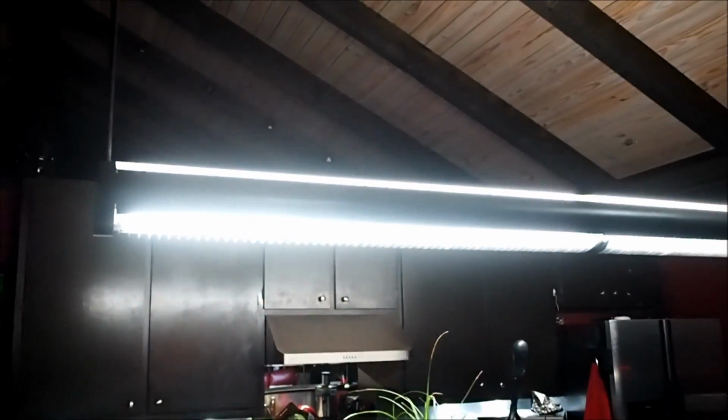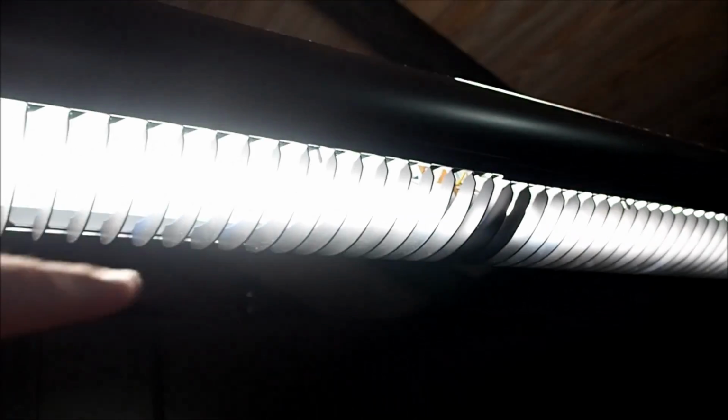Those fluorescent lights, you guessed it. You can get a fluorescent tube that has those LED light strips built into it. In theory, you can just replace a ballasted fluorescent tube with these. I had better luck bypassing the ballast because they're actually a little less power, quieter, and more reliable. And you can get those fluorescents in all sizes.